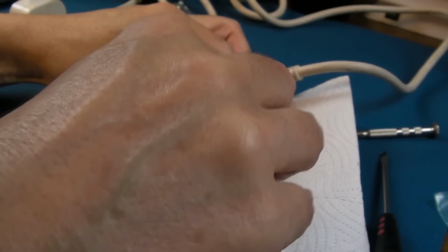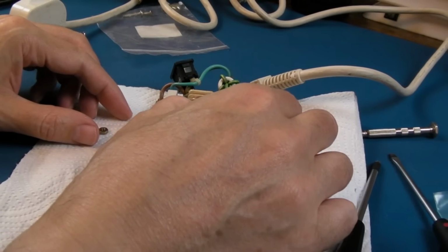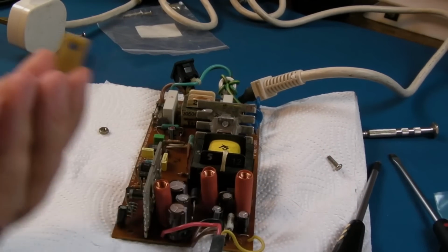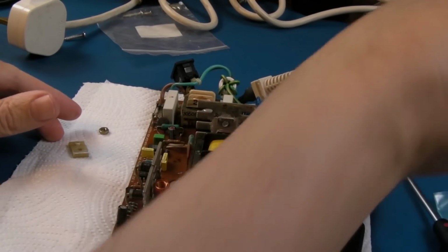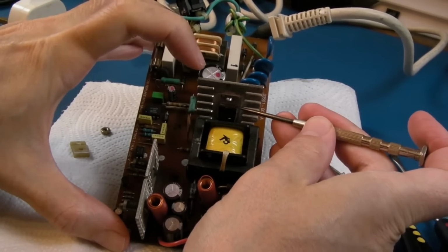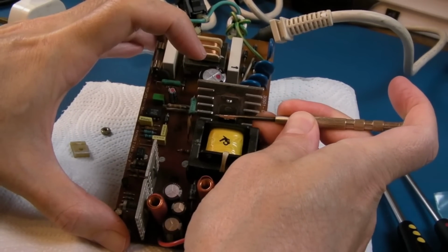And I'm going to get some new thermal paste on, because that's gone all dried and crusty. You notice the isolation tab here, plastic isolation tab in the front, so yeah, pay attention to things like that. But it's not isolating the transistor back, the transistor base there, I don't know if you can see that if I just tilt this up, it's actually making connection with the heatsink. But anyway, we'll just pull that forward.